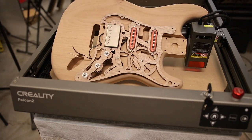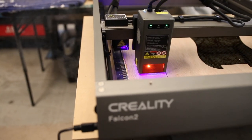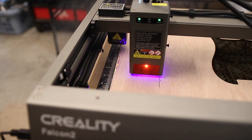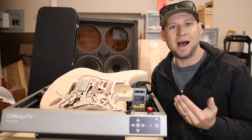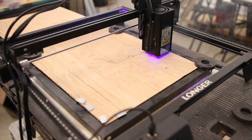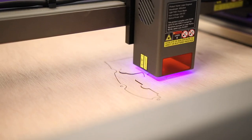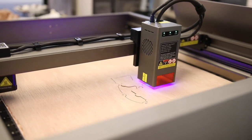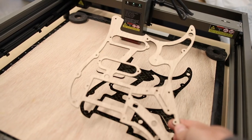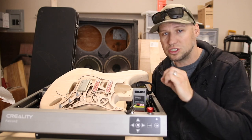There's a lot to love about the Creality Falcon 2. First and most importantly, the laser module is 22 watts, making it the most powerful laser I've used on my channel to date by a whopping two watts. I tried out the Acer laser, which I loved, and the Longer Ray5 20-watt, which I loved — and apparently that extra two watts actually makes a difference. With those other two lasers, cutting out materials, I kind of always had to clean up the edges in a few spots. I never had to with this one. I was using the same speed and cut settings, and that extra two watts just made for super clean cuts.